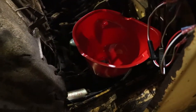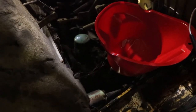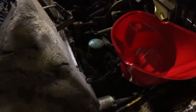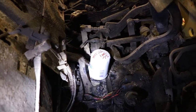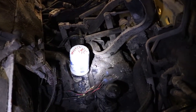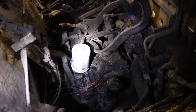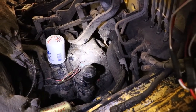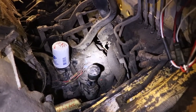That's really all I'm going to show you for this. When you're changing that filter, you'll want to use some cleaner and hose off the area so you don't get any fluid in. Here's the changed oil filter — I just tried to clean this off the best I could with some brake cleaner and wiped it off, so you can get that filter on there without making a mess. I'll mention the fluid checking method in the description. Thank you for watching.